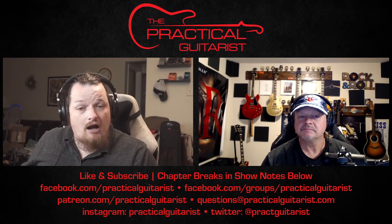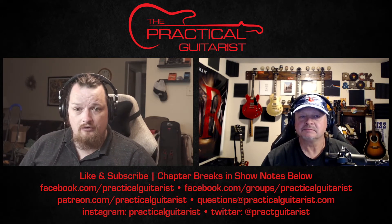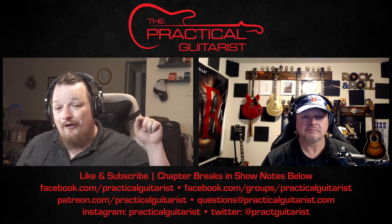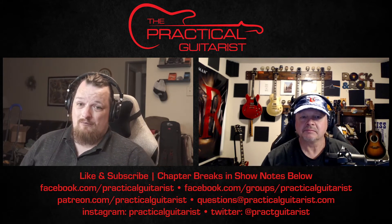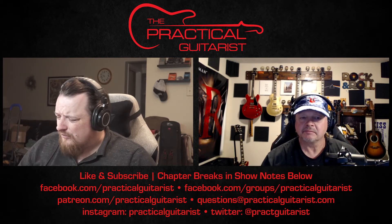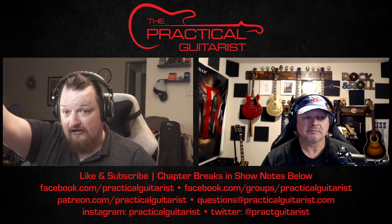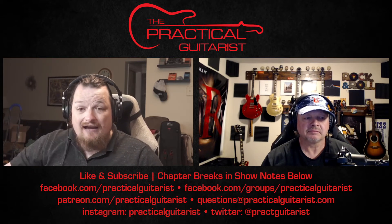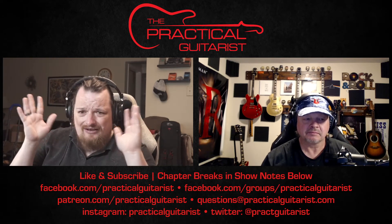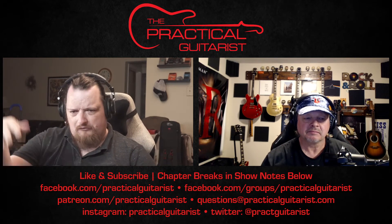What I do is put power on one side, audio on the other, and tie them down to one rail apiece. Cross everything at 90 degrees — just like in a music studio when you want low noise. In a studio you cross all your power at 90 degrees to your audio, and if you can, route power cables one foot away from audio cables. That's why those racks are so deep.